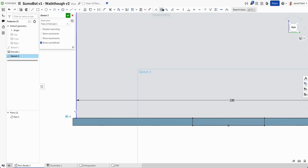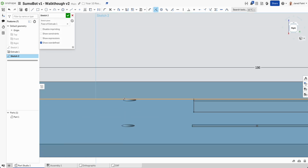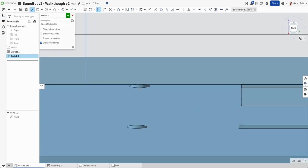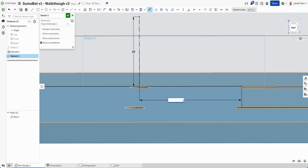Those are not fixed in, so let's go coincident. So it allows me to select that point and that fixes that in, so everything is tied in nicely. Now, the other things I need to add in here at the moment are my T-slots for those attachments. So the way I'm going to do that is I'm going to start with a line, make that a construction line, and I want to be able to go to about the middle of that and bring him up. I'm just going to go up 10 for the moment. Now I remember that dimension that I made from there to there, we made at 15.